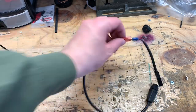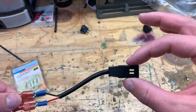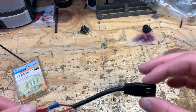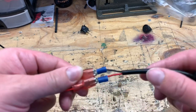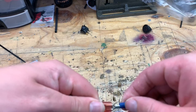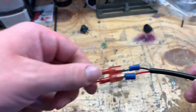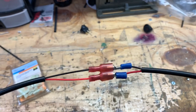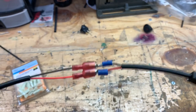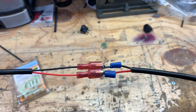All you simply do is take a Hummingbird power cord — all the power cords are the same, so any Hummingbird power cord will work. Strip the wires down and then add the female disconnects by crimping them on. I did that because I was in a hurry and had to go fishing, but I'm going to change this and splice the wires together so I don't have this big piece sitting here.